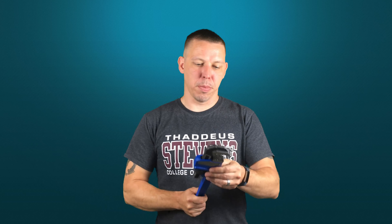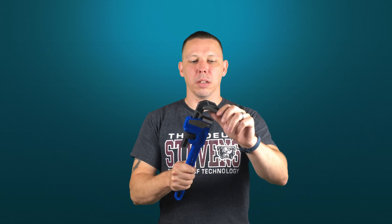The most important takeaways for pipe wrenches: they're only used on pipe, the teeth need to be clean to grab onto the pipe, and you can only turn in one direction. The biggest thing I want you to know is to not use these like an adjustable open-end wrench on hex bolts. People do it all the time and it just mangles everything. They're called a pipe wrench — it's right in the name, just pipe. You'll see other people using them on everything, but that's not going to be you. You're going to know better and get the right tool for the right job.